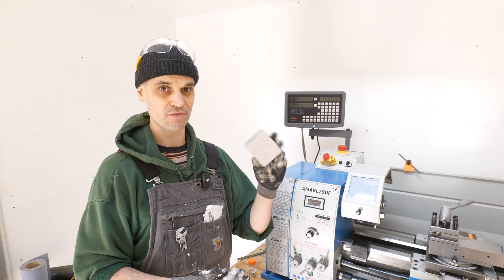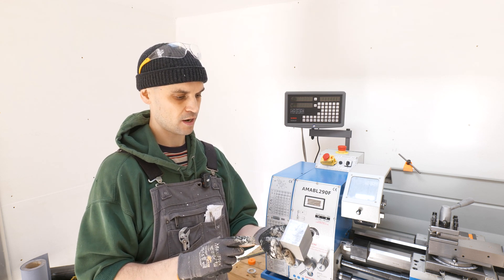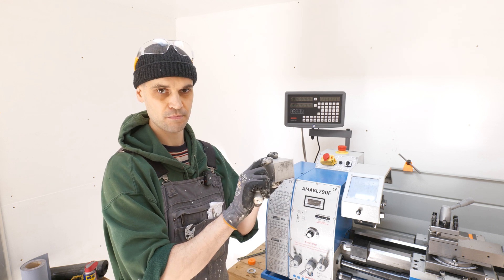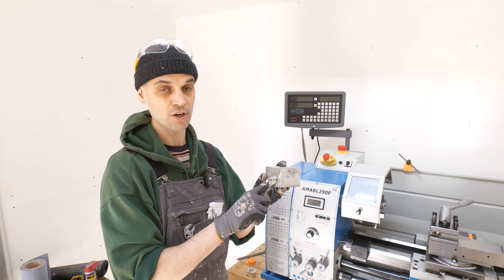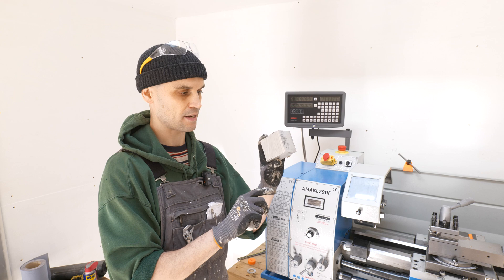What I have got is this leftover block of aluminium. So what I'm going to do is chop it into a 50mm by 40mm piece and then machine a 35mm diameter circle from this. That's what we're going to do first — we'll cut down this stock.